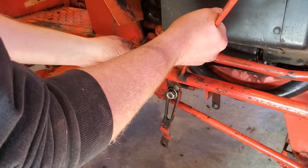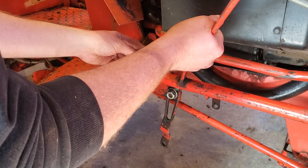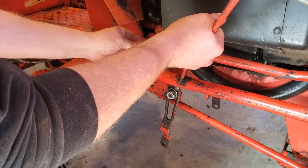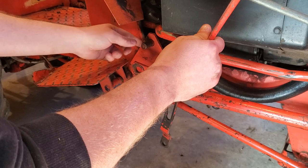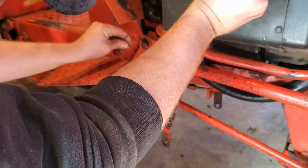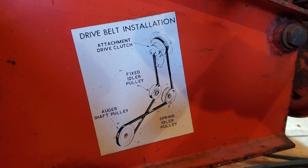All right, now that the lift arm is connected to the mounting bracket up in front, you want to take the other side of the lift arm that's closest to the seat of the tractor and install it on the lifting mechanism itself. Just like everything else, I keep all my pins in place where they should be when they're being stored, so I never lose one. Go ahead and take that pin, put it down to the ground. And if you have to, you can turn on the tractor to move this up and down. Mine's in place there. Voila.